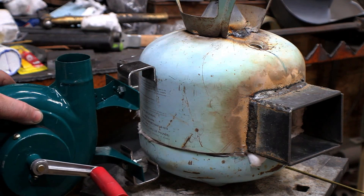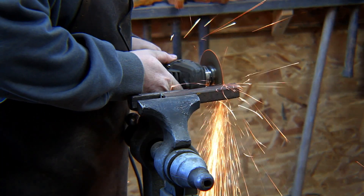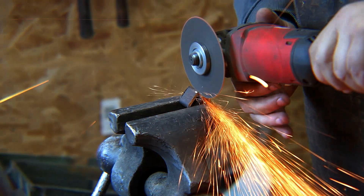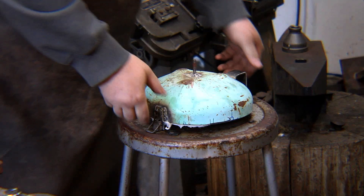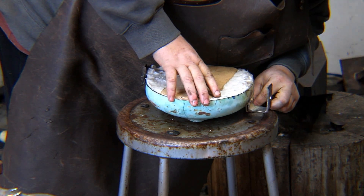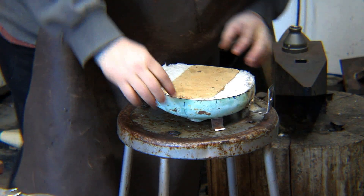Some of you might be wondering why I didn't just make a solid bar there — well, we need to be able to get into this forge for maintenance and we don't want to be cutting everything apart all the time. So we made those brackets so the forge can mount and hold one side together. We're also cutting some feet so it sits stable on the stand, which is an old chair with a stud on the bottom of the forge. The feet go on the bottom so it doesn't rock back and forth and we get a nice solid base.